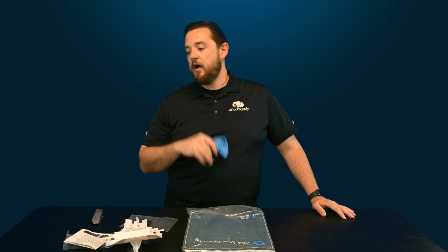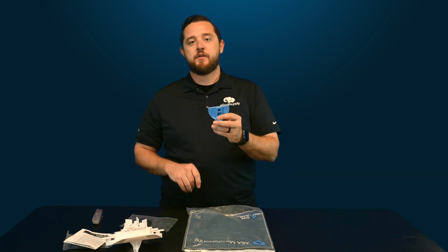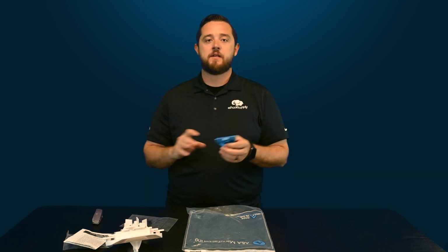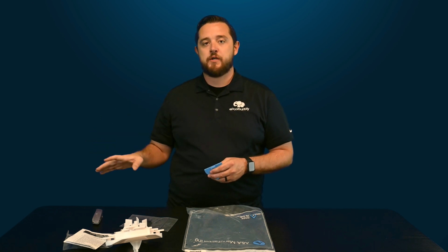So if you're dealing with a 2-inch, it's blue. In some of our other videos you may see we've got a pink and a green, and they do stick with a traditional white as well, typically for the 1.5-inch valves. So make sure you do your research before you dive in and just grab these gear kits, because they all differ a little bit to make sure they work efficiently for your specific item. That's one big thing: in the separation, they took the traditional white cam in this kit and turned it blue, then they made a 1.5-inch kit that still has the traditional white cam.